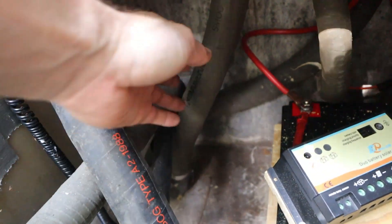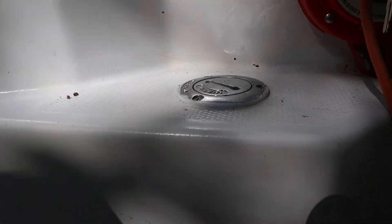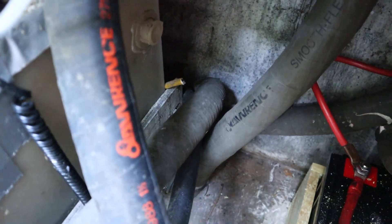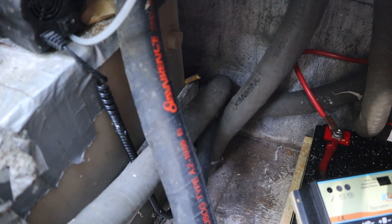We're going to take it apart and re-bed it. This big hose on the bottom comes up to where your pump-out is, to have it pumped out at the dock. Under here it's really hard to get to and hard to see, but there's a macerator pump right there. There's the hole where it's pumped down this hose and out. The hose in the back goes to the bottom of the tank. There is also a pump you can use to empty it straight out into the water, though if you're in a coastal region or at marinas you want it pumped out through the dock.